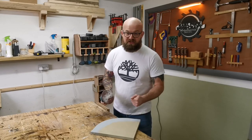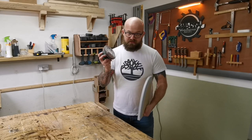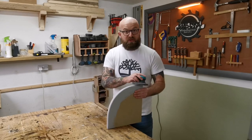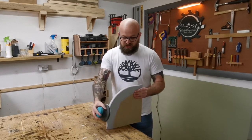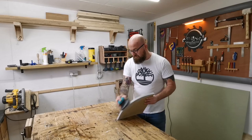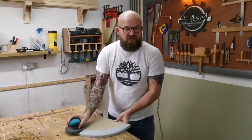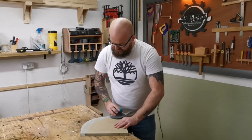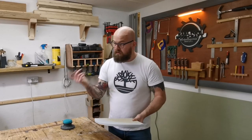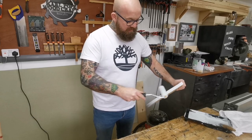Come back, de-nib again at 240, re-apply, and do that two more times. Two hours later, and you can guess what we're going to do — that's right, rub over the edge with 240 grit. The edge already is looking pretty nice and we've still got two coats to go, so we've only had one coat on. Don't forget we're not sanding here, we're just de-nibbing — taking any rough bits off and making sure there are no lips on the top and bottom of the shelf.